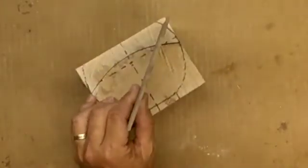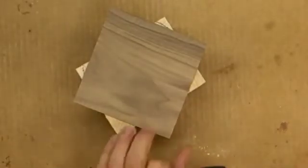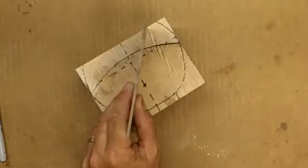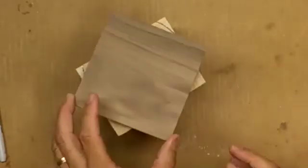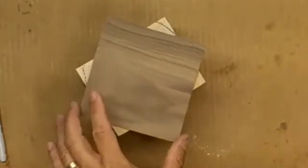This is 1/8 of an inch. I make them myself. It's milled very accurately, and that's real important. If you don't have the tooling to make something as thin as this, I'm running it through a drum sander that's real specific and real accurate. It's a company in upstate New York called Certainly Wood. They have a really nice website, and they sell non-paper backed veneers. Real important that if you use a veneer in wood turning, you don't have the paper on it because it's not strong enough. But they also sell them thicker.